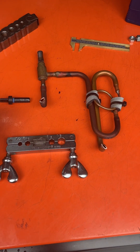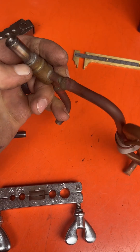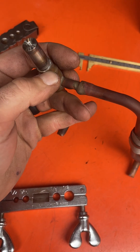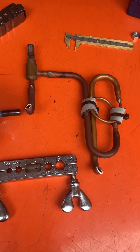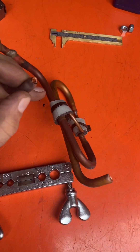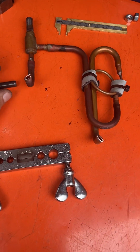I'm working on a real old LG Multi-V and this solenoid here took a dump and it's leaking real bad. I got this off an organ donor and it's in such a tight space I just cut it out — it wasn't even worth trying to get a tubing cutter in there.